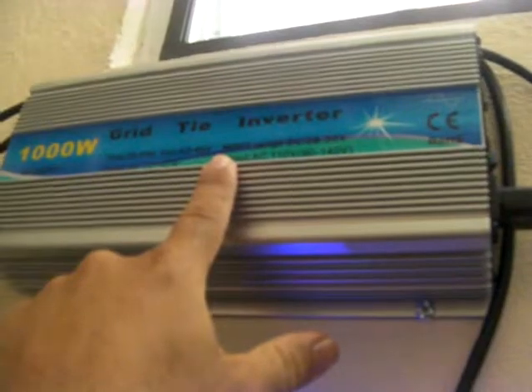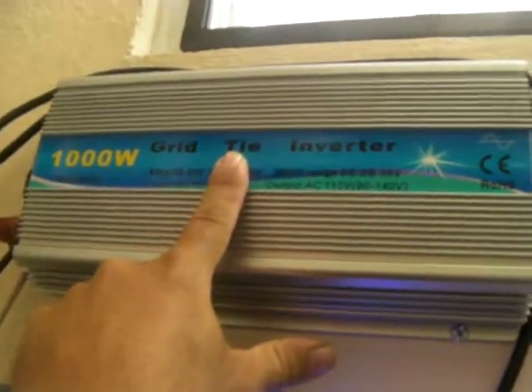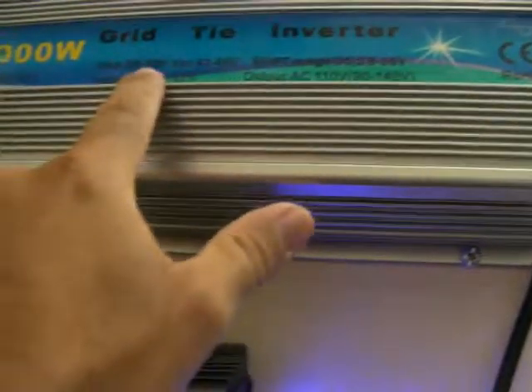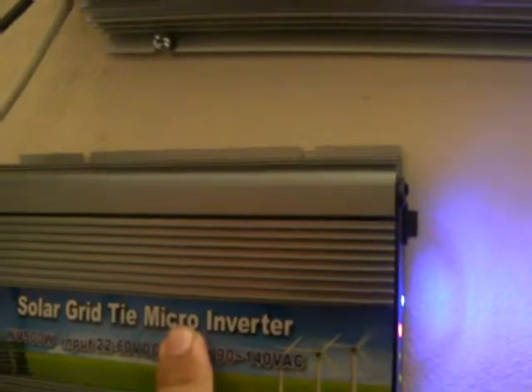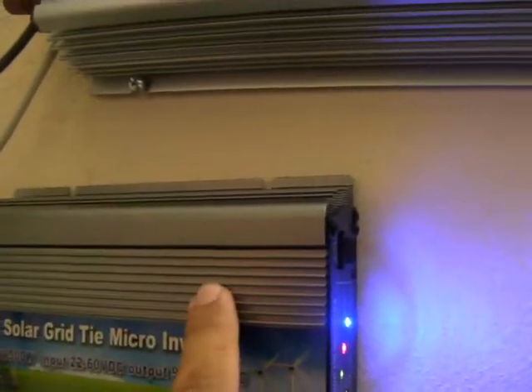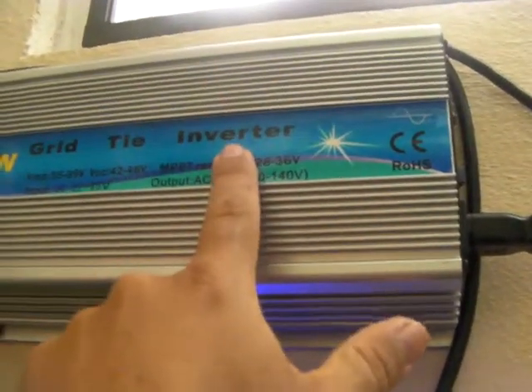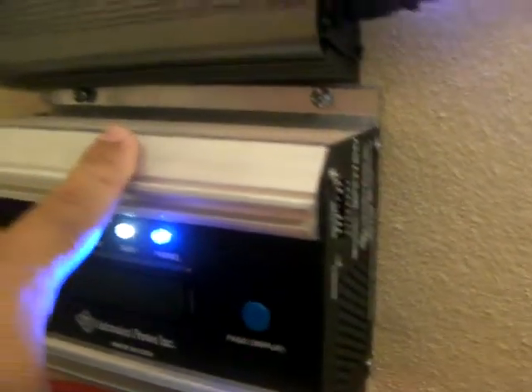That's kind of neat — I did it by chance, but that's what I saw, and I'm glad I combined this one with the Intronix. I tried to combine the Supra and this one with the same panels, but since this one starts at 28 volts and the Supra starts at 22, the Supra took all the load and the other one shut down. So what I did was separate the panels — I added two more panels connecting them to the Supra, and the other six panels I left with this inverter and the Intronix.